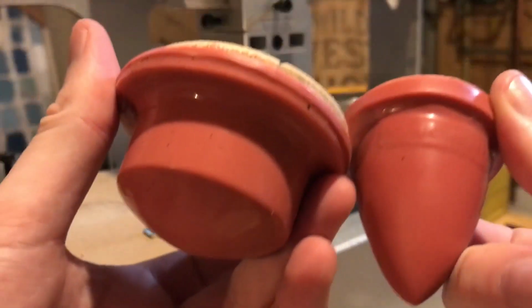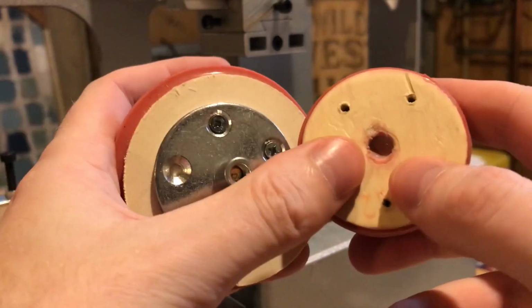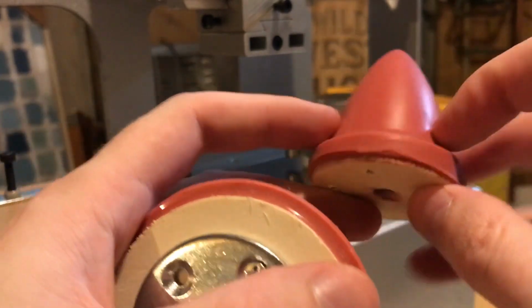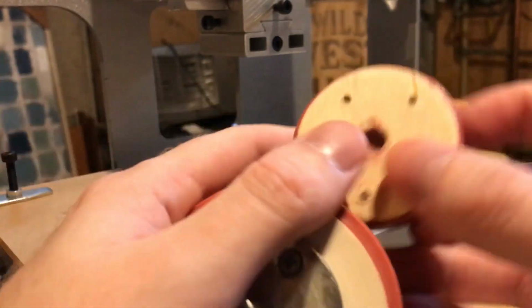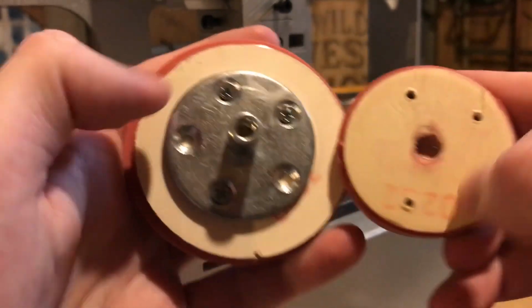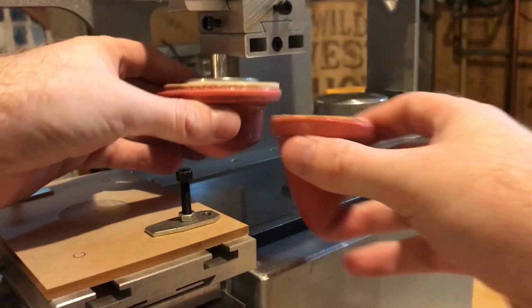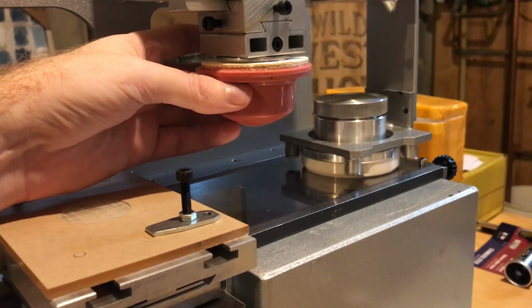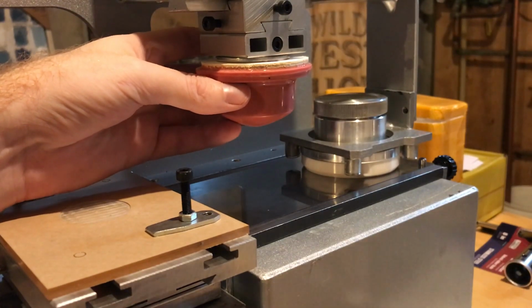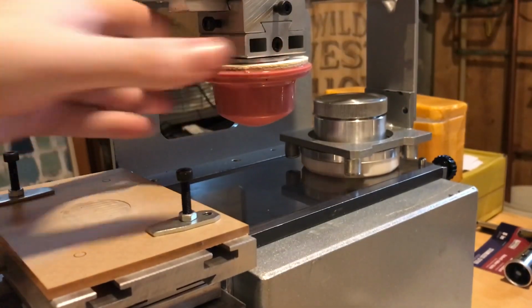Here's again a different pad for different types of surfaces. All you gotta do is put the holder on top of the surface. This is just wood, and the silicone is wrapped around it, adhered to it, basically glued to it, and drill the holes in the right location, attach that, and then you can put it in the printer depending on which silicone pad you want to use. So let me attach this back to it to walk you through the example.